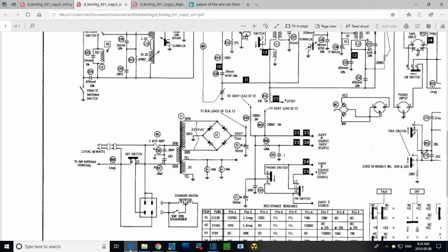So it took me a long time last night to trace that big white capacitor back. The capacitor size is 0.1. I don't know for sure it's the correct size that's been put in there, but I'm pretty sure it is now after looking at this. Dead center of the screen, you might be picking up the 0.1 that's sitting right there. I spent an awful lot of time studying other parts of this schematic until I finally got my eye way over here. I won't go into the long journey it was. So that's the one I'm thinking of changing on the 160 volt power source coming out of here.